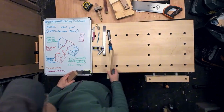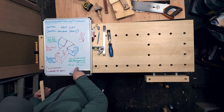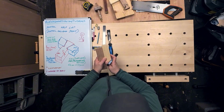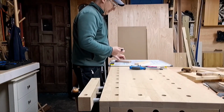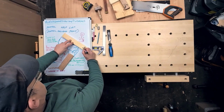Let's get a marker. Check out our working drawing. Here's a bit of scrap, a couple of pieces of scrap timber. 44 by 22, it's pretty close. These aren't actually 100% flush, but that's okay, because when we go to mark it out, we're going to have the faces end up being flush by the very end. So that'll be fine. Let's lay them out there. That's that and that's that one. So I'm going to do that as my face. I'm going to call it the pin.